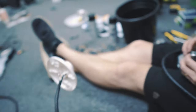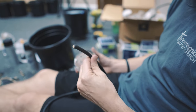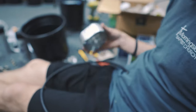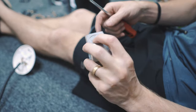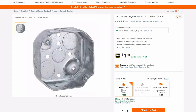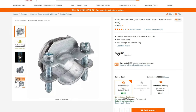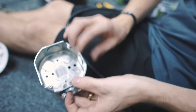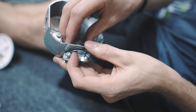So we have the base on one end of our cord and Hunter has the other end that does not have the plug on it yet. We're going to put our clamp connectors — I can't remember exactly what they're called, I'll have the name on the screen — and insert them right there. Put the ring on the end and tighten that down. Then we'll loosen these two screws just a little bit to be able to feed our cord through. Three-quarter inch is what we have.